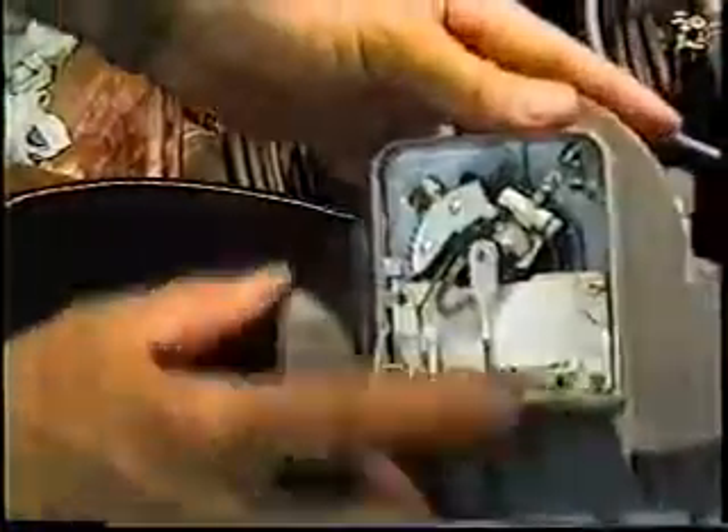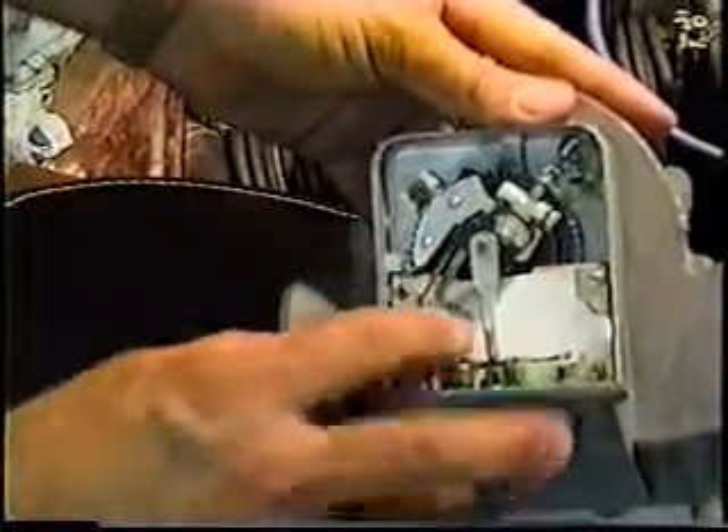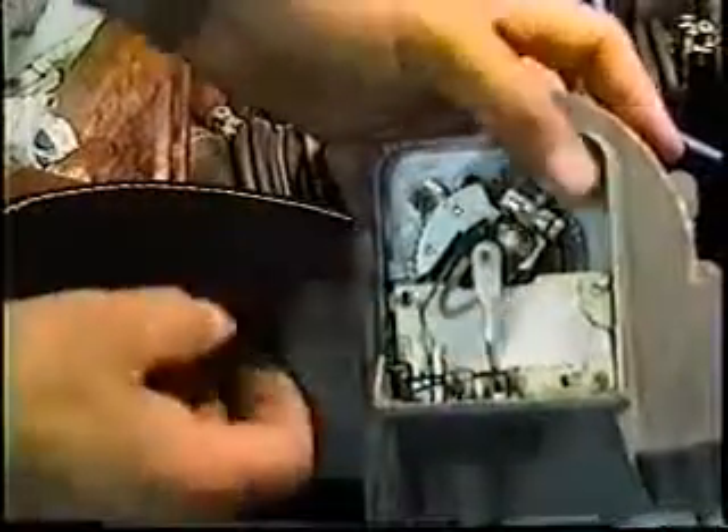Rub this back and forth and pull it off. I don't know if you can see that, but there is a very minor amount of black that came off there. Start off with another clean piece of paper and insert it down on the wiper strip itself. What we're cleaning here is not the contact itself — we're cleaning the brass on there. So then you just simply cycle this across there. This one here is bent — that's why this is a dead core. They reached in and during the cleaning process, they bent these brass contacts.